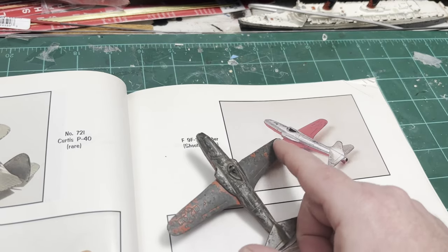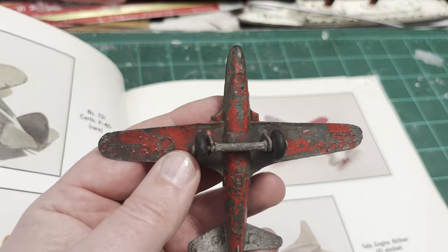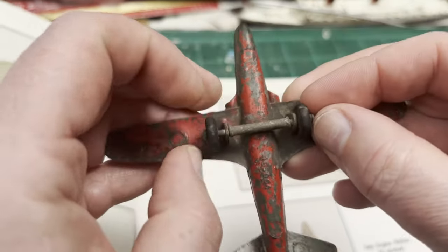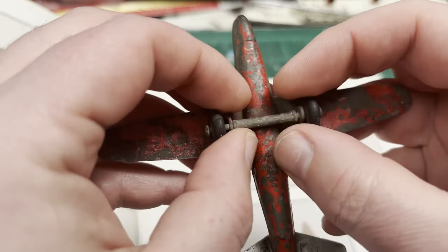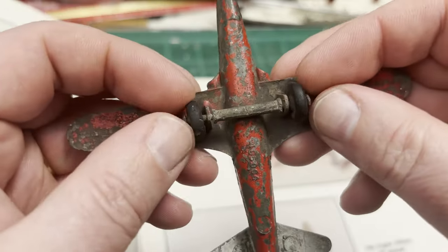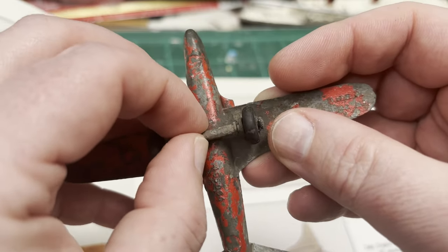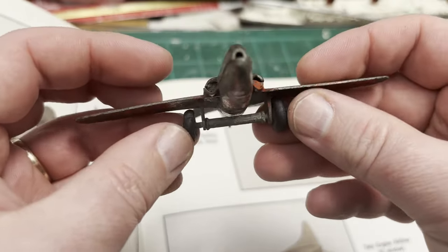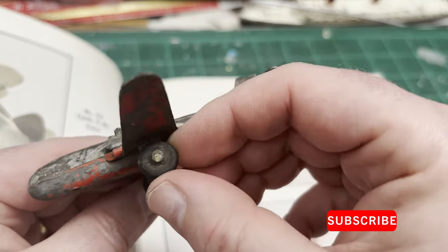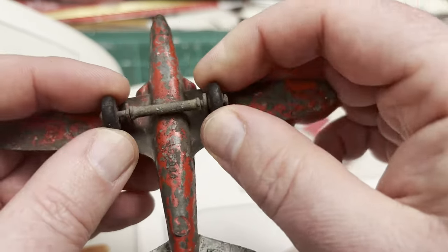It's supposed to be silver on top with a red tone for the wings and the underbelly. When I say it's going to be a little bit more difficult, I mean these tubes here. I've been told you can just pull these out, but my experience is that you can't. This is cast onto these steel brads. The only way is to cut this, then remake it because it's exposed, so I need to make it look nice. These wheels are not in great shape — that one's got a chip out of it, so I'm going to have to remake these wheels.